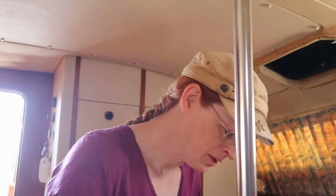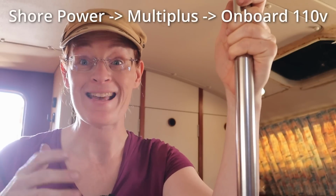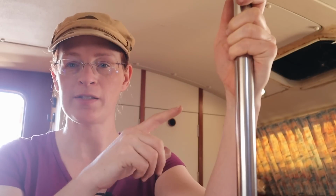Marina coffee. Only one, but gets things running. I have to get the AC side up and running. I think from last night that I have to get the Multiplus up. I need to sit there and look at the 120 volt a bit better to make sure that that's actually the case. My biggest concern really is somehow putting power out into the water and boiling off my zincs. I'm sure there's a way I can go straight from the AC in and just bypass and light up the rest of the 120 volt bus, but I don't want to take that chance. So I'm gonna get the Multiplus installed and that should light up everything.